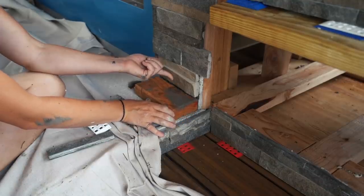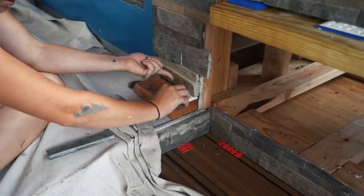When I made it down to the hearth, I just set in place a 2x4 spacer. In a perfect world I would have done all of the countertop surfaces first and then stoned up to it. However, it was going to be like another week before the concrete forms came in. So instead of halting, I decided to do stonework first and just leave a spacer for the countertops to slip in afterwards — I used a 2x4 to make up a one-and-a-half inch space.